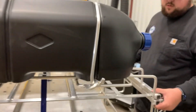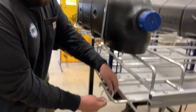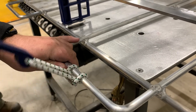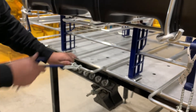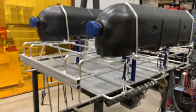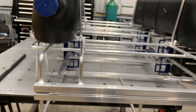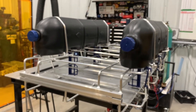All the floats are now locked in place. All that's left is attaching the gators — take the clip, pinch it on there, the clip goes in the middle of the knot, pull it tight and lock it in place. Same again on the middle, and that is a fully assembled ProFlow hybrid shift cage. Pretty straightforward — designed to be easy and use minimal tools. This is now ready to go in the water. Any questions, let us know — cheers!